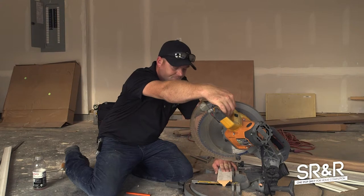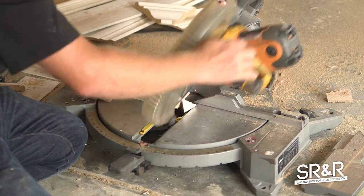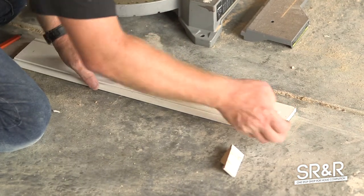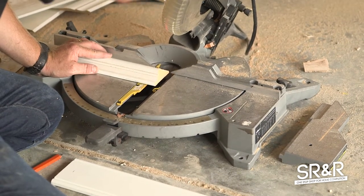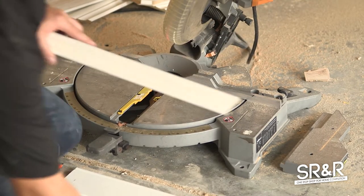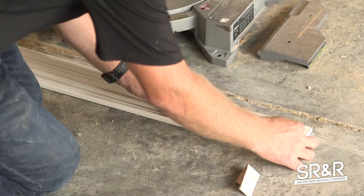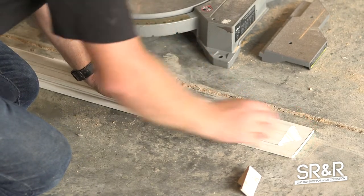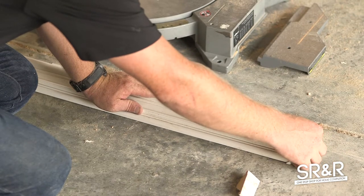Next, move to a 22.5-degree angle and cut this board down. When you put these together, set that one down there, then take the top piece, flip it back over, and cut it down at a 22-degree angle again. When you put this whole thing together you have a pretty piece of trim that looks like it's coming out of the board. That's how it looks — you have a 45 and a 22 and a 22 — and then here you have the return on the bottom of the base.